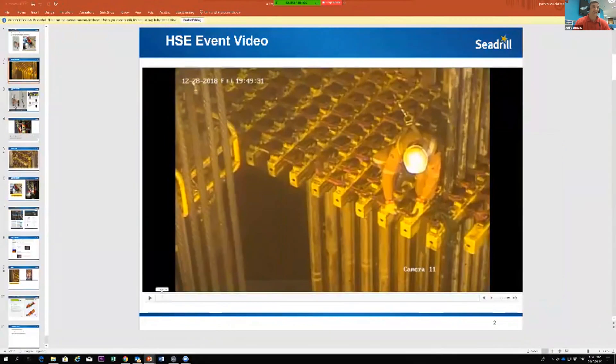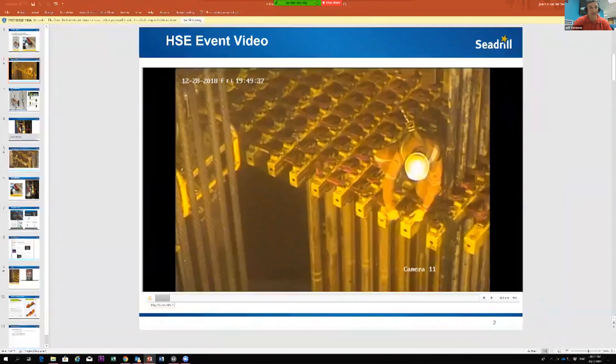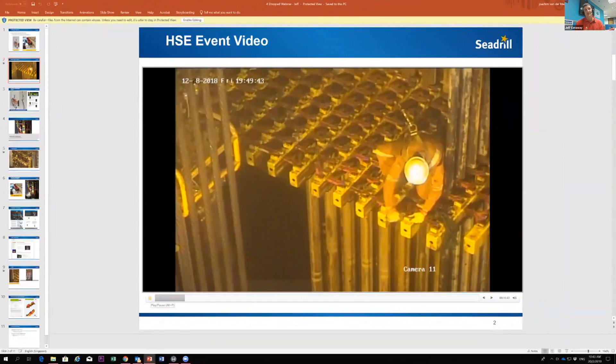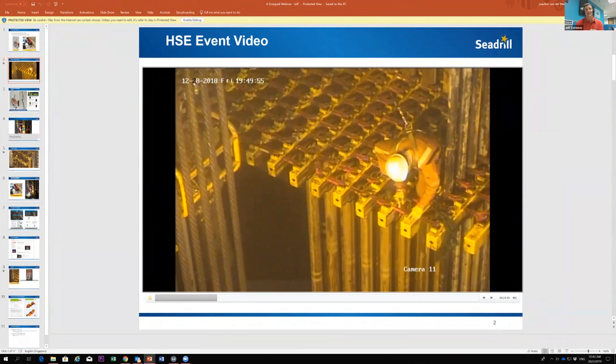When the mechanic's out there, he's got his tool bag and all his tools. He's changing out the finger. During the video you'll see it zoom in — that's when one of the spanners actually fell down to the rig floor. The video continues and zooms in again, and the other spanner goes down, but this one is actually attached properly to the lanyard so it doesn't fall to the drill floor.